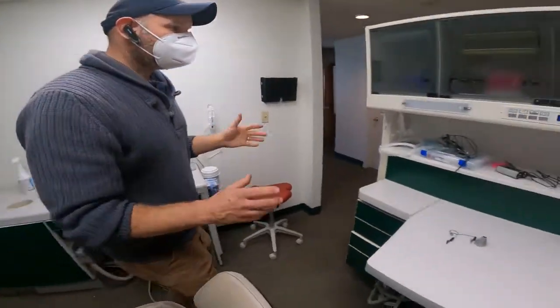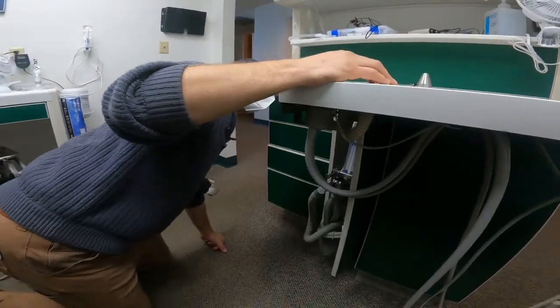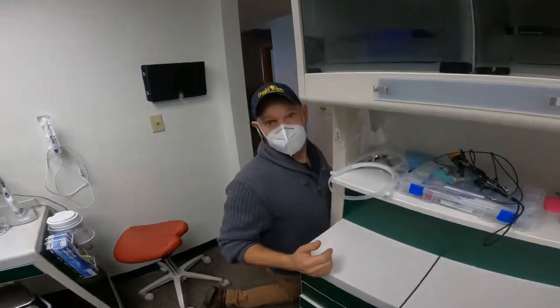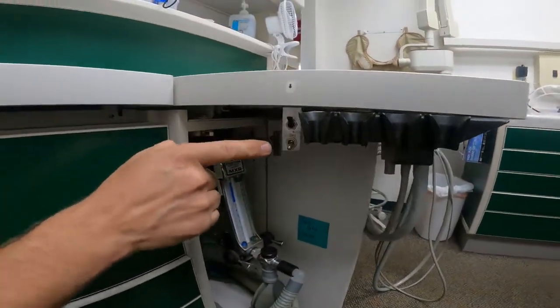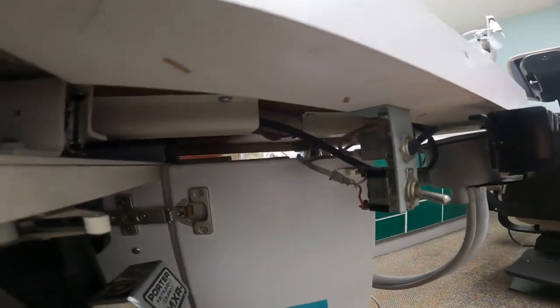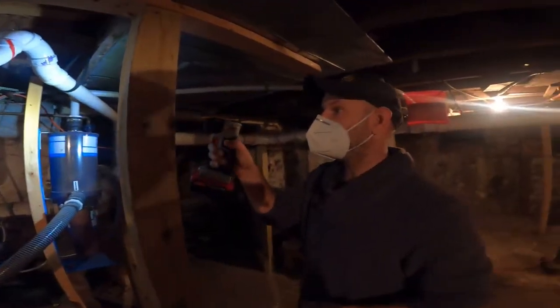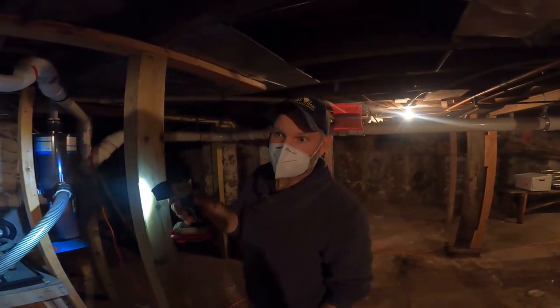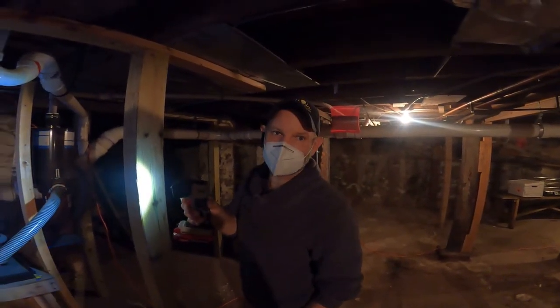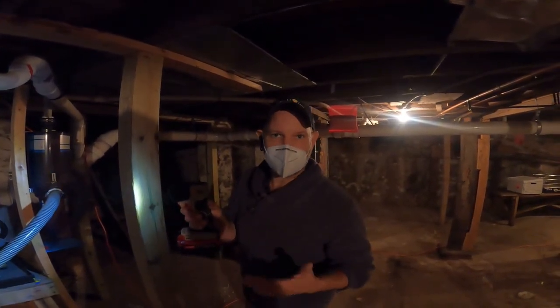Let's look at these rear cabinets — we're just going to look at this cabinet really thoroughly and see if there's any switches that are down in here. Come over here, watch this, right here — look at that. That looks promising right there. It's flipped in the off position, and we've got wires that are similar to the ones we were tracing. Let's see what happens. I actually need to double check to make sure I left the vacuum pump on — I might have left it off. I turned the switch on so if we're able to get it then we know that was it. I'm thinking if this unit is driven by that switch solely, we're going to take all this other wiring out. I have a feeling it actually goes to a switch that probably isn't even known about by the doctor — it's been probably on for years and nobody's touched it and it finally got bumped and turned off.